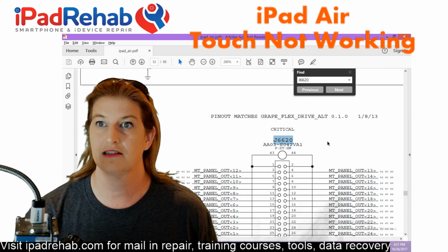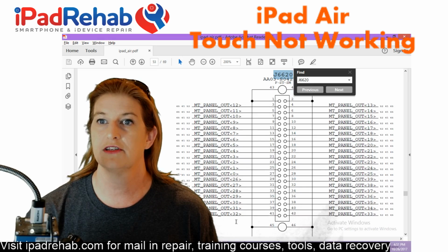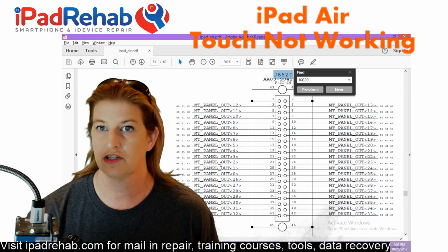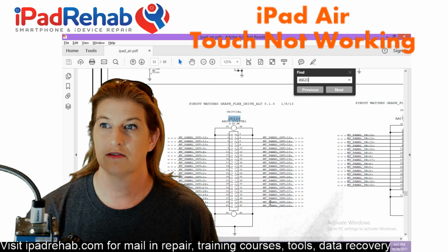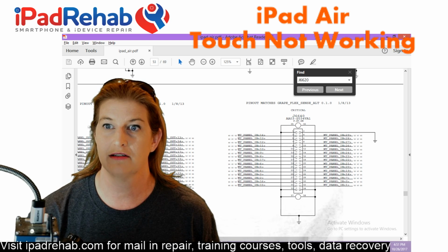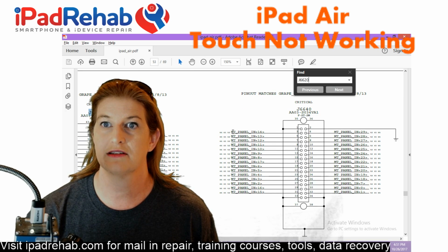All right, so this is the digitizer connector. Pinout matches grape flex drive. All right, so all of this looks like data for the screen. So none of this is going to cause no touch. I would expect any of these to be short to ground or open line would cause a dead line of touch. So let's see what else is on this page. The other digitizer connector. So all of these are MT panel out. These are MT panel in. Same thing. There's ground. That's it. So none of that is really helping at all. So connector is not going to be it.